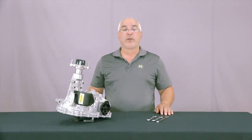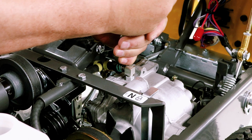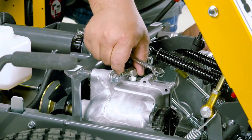As a note, in this video we are using an MS-18 as our example. The MS-14 will differ slightly as the reservoirs are mounted on the transaxle, and when servicing those units you will need to remove the reservoir and the reservoir retainer to refill the transaxle. Remove the oil reservoir hose attached to the elbow on top of the transaxle and the elbow to access the oil fill opening.